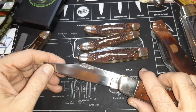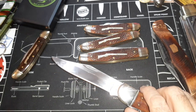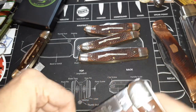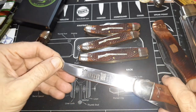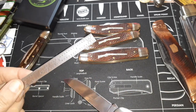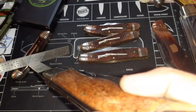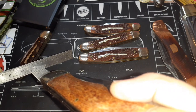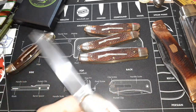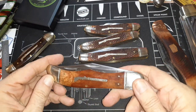You've got a nice saber grind on this blade. Now, one way to tell if something is a flat grind or a hollow grind: get something rigid and put it on the blade flat. If it makes complete contact all the way down, it's a flat grind. If you get a dip or gap — usually a belly through the middle — you've got a hollow grind. Sometimes it's pretty subtle — you might have just a slight hollow grind in there.